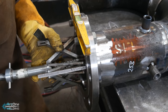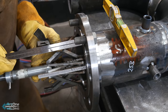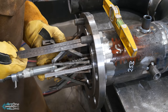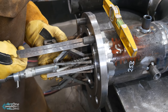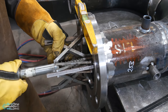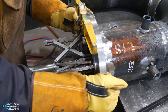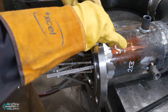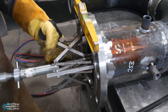Once I tighten up the internal clamp holding the spider clamp to the pipe, as long as I pull the flange out as far as it can go, so it's maintaining contact with them three tabs, I can make sure that I can adjust the bolt hole so that it's two holes tops level, while making sure that the measurement from center to face of the flange doesn't move. I never noticed that before. I was just a bit delicate trying to get the measurement and moving the hole of the spider clamp.